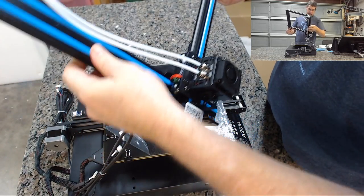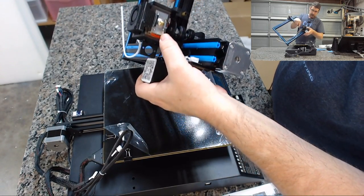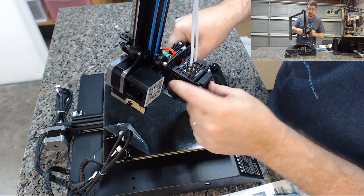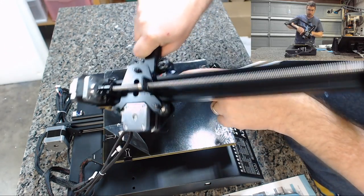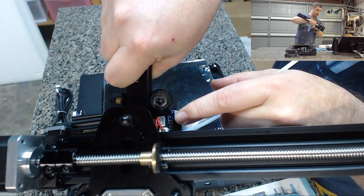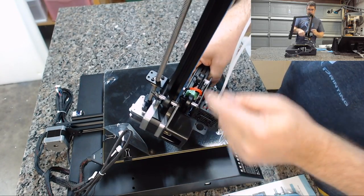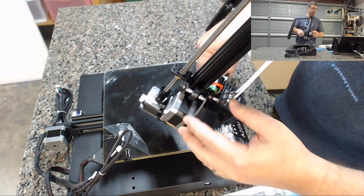Here is the hot end in the chassis — this is the newer, more pointed nozzle that the newer A10Ms have included. One thing I've liked about all these printers is they have a BL Touch mount. GTech's 3D Touch is their clone version, and there's a pre-pinned header here. To install a BL Touch, you just use two screws, adjust your height, plug into the five pins on the back, flash the BL Touch firmware, and it's done.